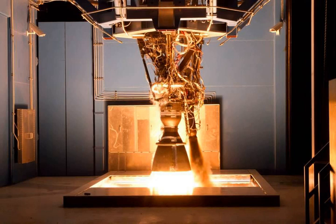At full power, the MERLIN vacuum engine operates with the greatest efficiency ever for an American-made hydrocarbon rocket engine. An unplanned test of a modified MERLIN vacuum engine was made in December 2010. Shortly before the scheduled second flight of the Falcon 9, two cracks were discovered in the 2.7 m long niobium alloy sheet nozzle. The engineering solution was to cut off the lower 1.2 m of the nozzle and launch two days later, as the extra performance was not necessary for the mission objectives. Even with the shortened nozzle, the engine placed the second stage into an orbit of 11,000 km altitude.